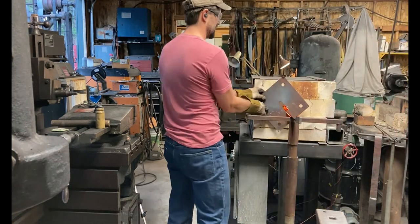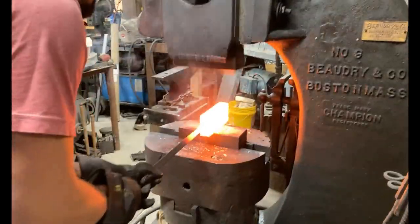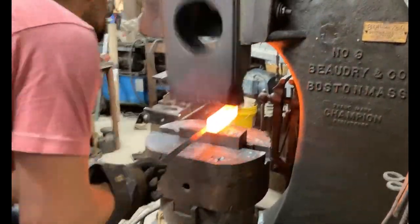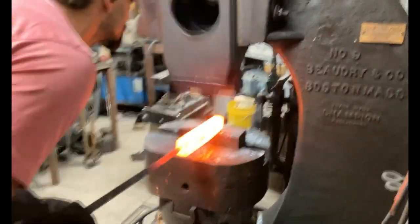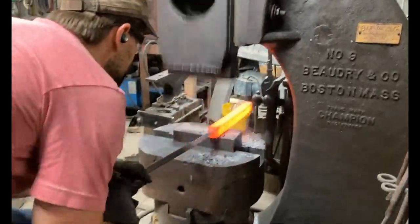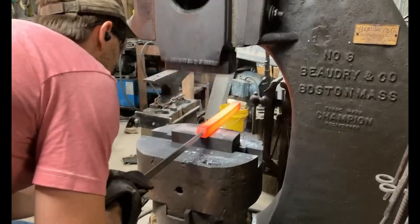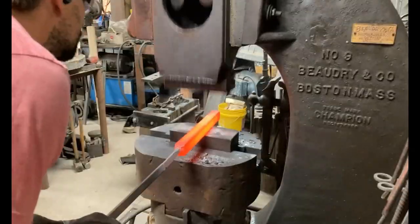The billet is going into the forge, heating it up — hammer time. The first two hammer clips in this video are the last you'll see with much hammer bounce at all. We're welding this up; you can see it's nice and bright. It's just a big stack of thin layers, so we're going for it on this first one — not babying any welds, smashing it down and drawing it out. I also figured out this is not the best angle to film the hammer from — it's right between the two hammers, so pretty hard to eliminate shock.